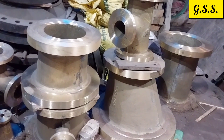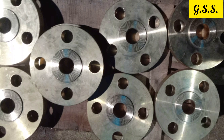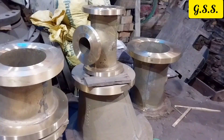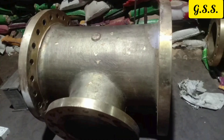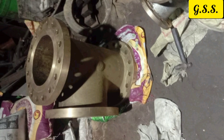This type of cast brass fittings and cast brass flanges are mainly used in oxygen lines as exempt material, because brass is inert and does not react with oxygen. Also, these are used in high corrosive areas like marine industries.